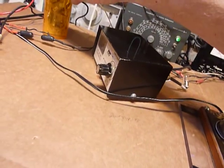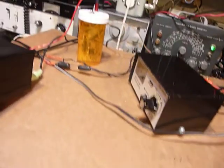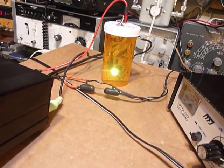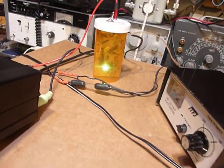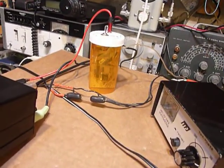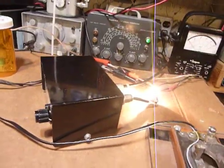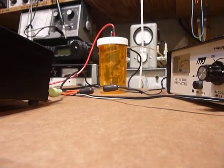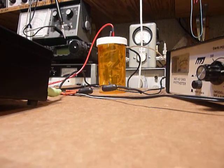I also wanted to show that with the decoder on there, it lights up when you push down the key — that's what I'm demonstrating here. So it gets the 700 Hertz tone, and that's what you use to align the decoder when you build that little board.